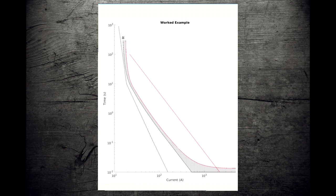If you manage to blow up a transformer and damage it in 16 thousandths of a second, you were delivering some serious energy to that transformer. And the likelihood that this failure over here is going to be energetic is very high. Energetic is code for blew the lid off of it and spilled flaming transformer oil all over 4 lots. So, the chances of bad stuff down here are much greater than the chances of bad stuff up here.